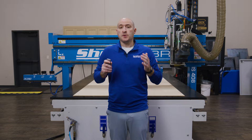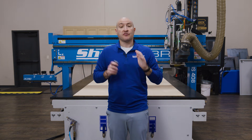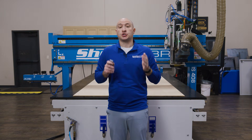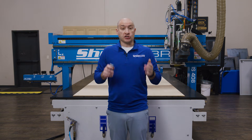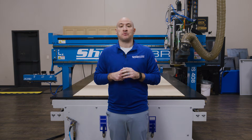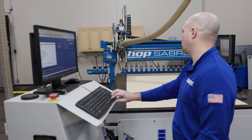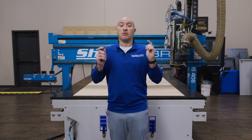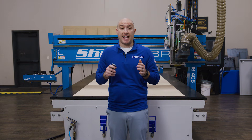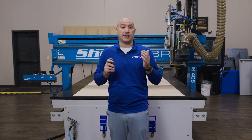Before we start cutting, there are a few important things we need to discuss to ensure performance is at the level you'd expect. First and foremost, there are right and wrong materials for this type of work. Make sure you're purchasing door-quality MDF — there is a large difference in material quality, and the wrong materials can leave you frustrated. The next thing to be aware of is making sure the machine you're running is calibrated and ready to go. This means resurfacing your spoil board before you start cutting that day, because heat and humidity vary day to day and can show up as variation in your material.